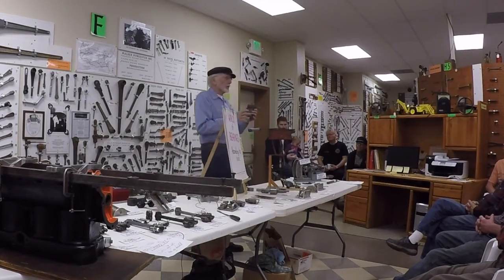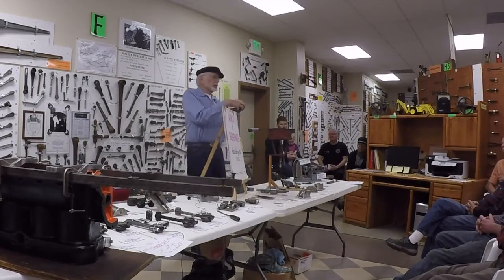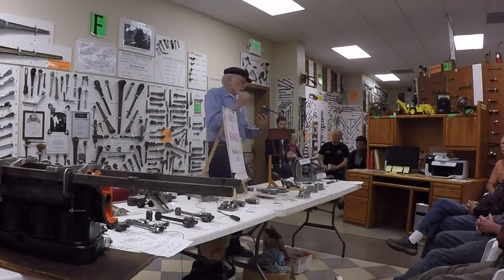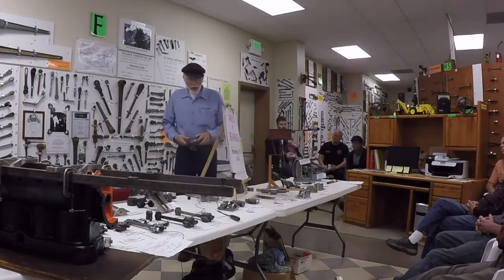And then before it gets real cold, if you're using one of these models, and I don't know where you'd ever get one, you get a hold of this handle and you yank the hell out of this one, munch, and the Babbitt that went through those holes will shear off, and that's what gives you this thing. And then you dump this back in the pot. See, that was right down in there. So you pop it loose, and then give it a second or four to cure or harden up. And then take it apart and go to the next one.